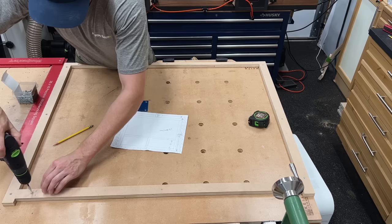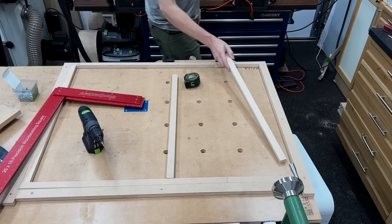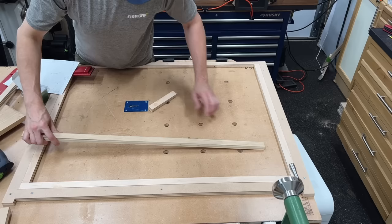I'm bringing this down to about seven-eighths of an inch, which is how I like to create most of my cabinetry — gives it a little more beef. With the measurements I took on site, I'm going to build a real life-to-scale reenactment of the face frame that is in place, so I can size my four drawer fronts exactly.